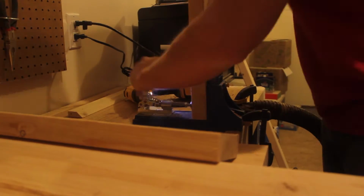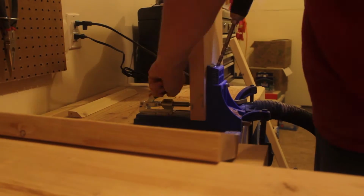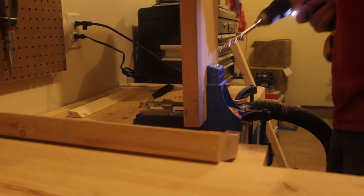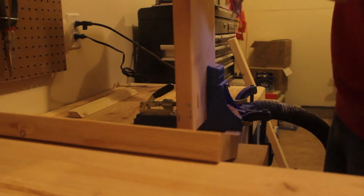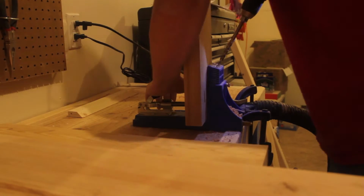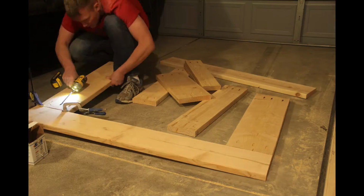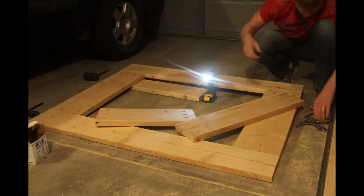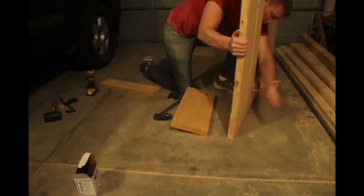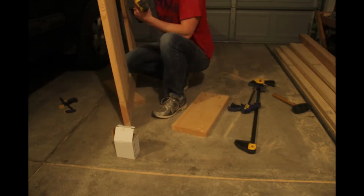Now, all the pocket holes. I think I was not using the pocket hole jig as well as it could have been. I wasn't going down far enough with the actual drill bit into the wood. I was doing what they recommended with the recommended length and width of what I was working with, but it just didn't seem to grab the extra piece as well as it could have, so I went a little farther. And now we have the assembly of just the initial tabletop itself.